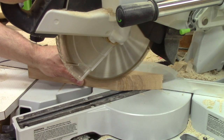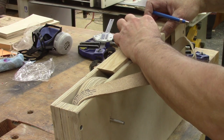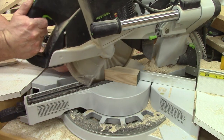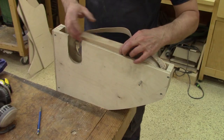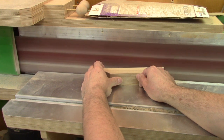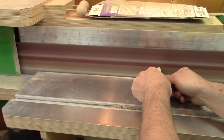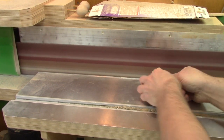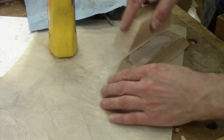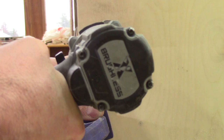Perfect now. I only need to cut one end at 45 degrees. I put it in place, mark what I need to cut, and cut the other side. This is perfect. But the ends are a bit too sharp for the leather — I bevel both ends and make sure the tip is really not sharp at all. Then the cutoff is glued to the other piece. Now I just need to wait for the glue to dry. When it is, I screw the back support in place.